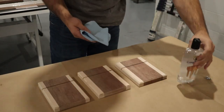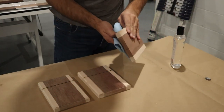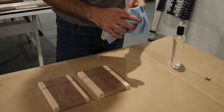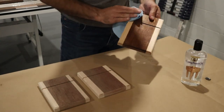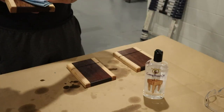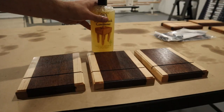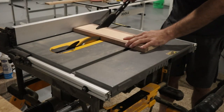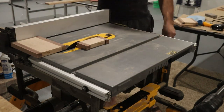After catching up the other two boards to the first test board, the next step was to apply some cutting board oil. This is the kind of thing you don't really think of as an essential step, but after you do it the first time and see the difference it makes in the wood color, you wouldn't do it any other way. After two coats of oil the boards were looking just beautiful. I finished up with a coat of butcher block conditioner. I made a bunch of other boards out of other cuts of wood and got those caught up and oiled just like the first set.